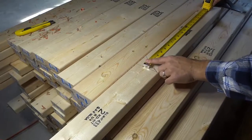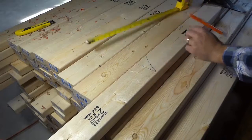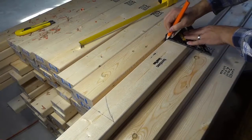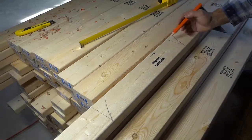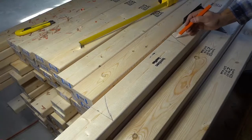I'm going to take this measuring tape, place it on that line, and do 16 inches again. I'm going to get my speed square and mark it out — there's the 16 inch mark, just like that. Draw a line like this, and we know that the next stud is going to start right here and it's going to be filling in this space right here.